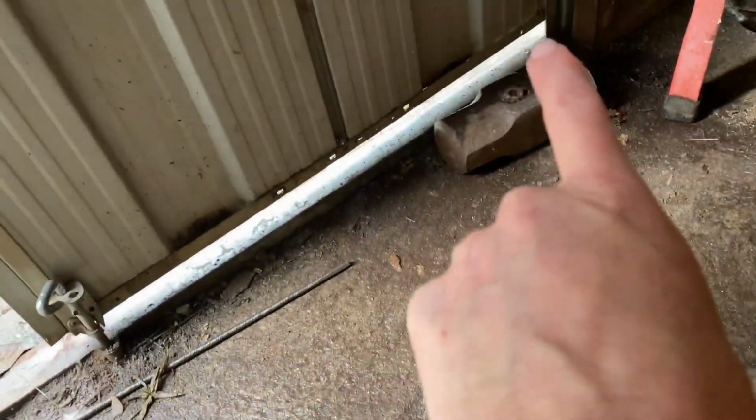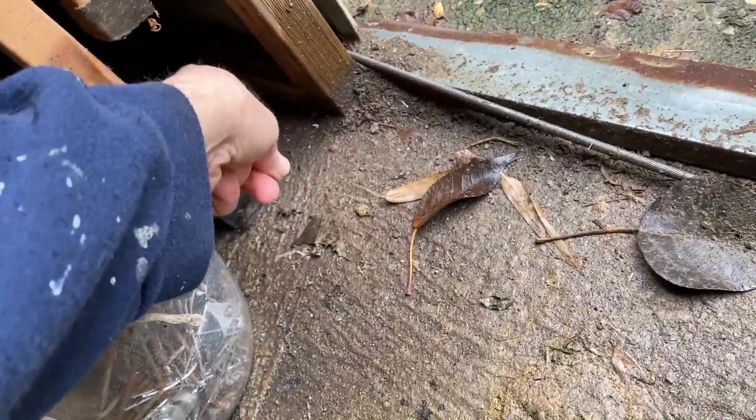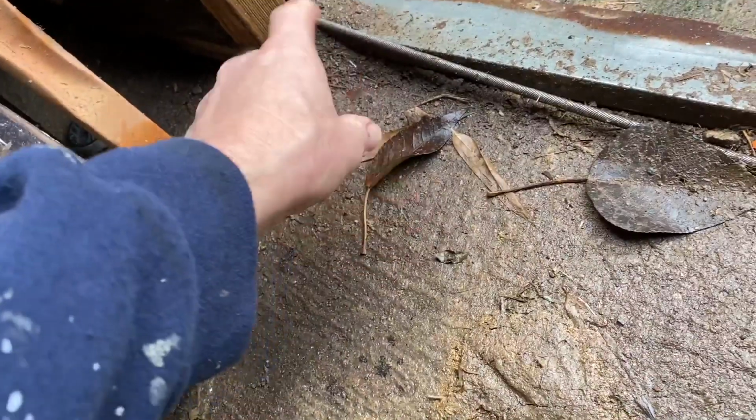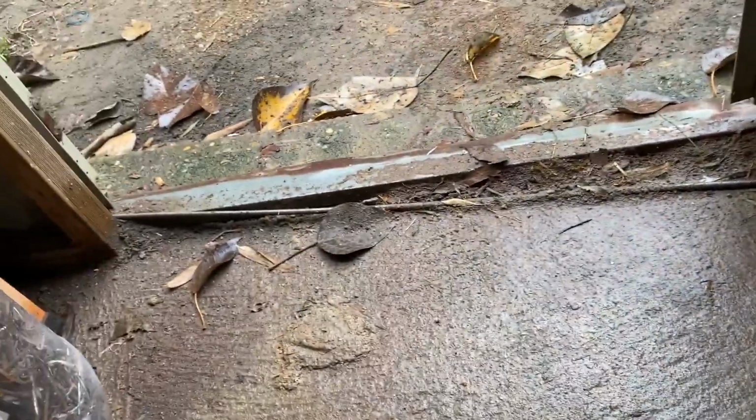We had a bit of rain during the night, and so this is still an issue with this workshop, and it'll probably never end because it's always going to splash underneath the doors, I think, unless I can get some rubber and attach it on the base so that when you close the door it swoops out against the edge of this lip. It could well be that's the only spot the water's coming through, because I don't see any water up in that corner. I mean, there's water here. I'm glad I used treated pine for this framing. There's water up there, and it's probably just soaked up because of all this mud and dirt that's collected here. And down that end, same thing, but then it runs through the shed. So if I can stop it from coming in, I might have a win. Job for later.